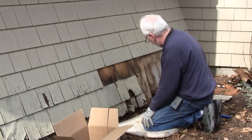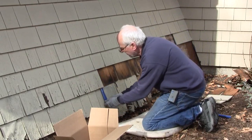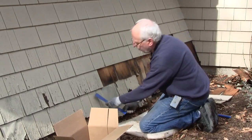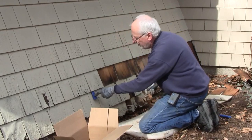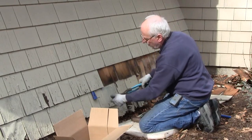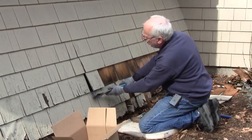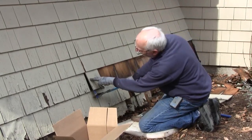So I want to remove this shingle. I'll take my thin pry bar and I'm going to slide it up under here and look for the nails — just go like this. And this one slides right past where I know a nail should exist, so the nail on this edge has completely rusted through. That should not be hard to pull out at all. That nail seems to be still intact. So that nail sits right about here somewhere. I want to lift this up just enough to pop it off the head of the nail. Take this to my channel locks and give it a twist. Okay, so what happened there was instead of popping off the nail, the nail pulled out.